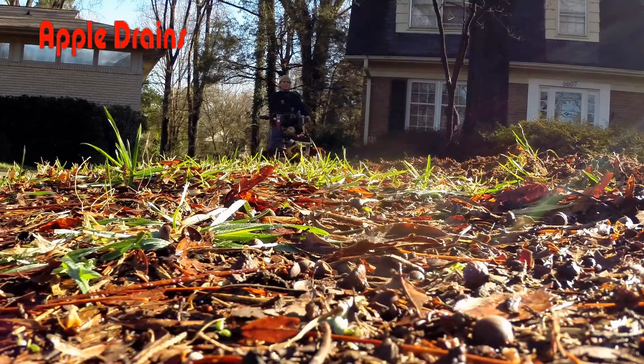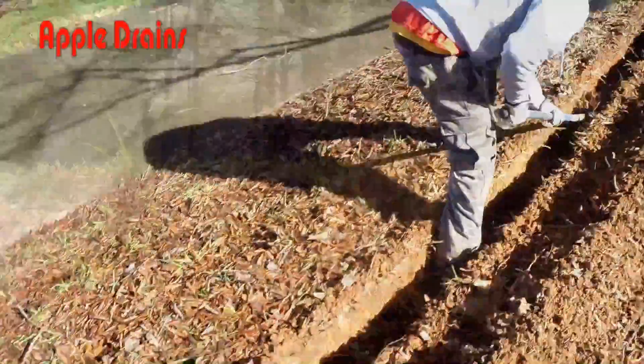And you'll see me kind of disappear over this hill because this is a rise of about 15 feet. We're going to put in a Zoeller M53. This is a one-third horsepower pump, and we're going to push the limit of this pump. We've finished trenching our inch-and-a-half discharge.